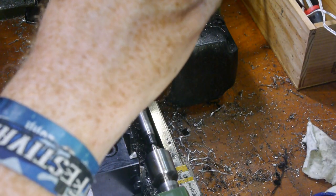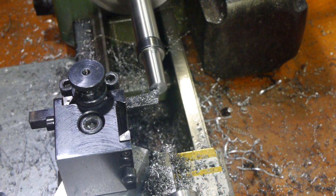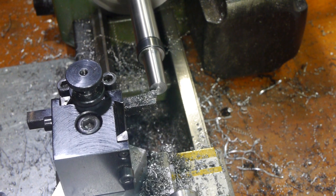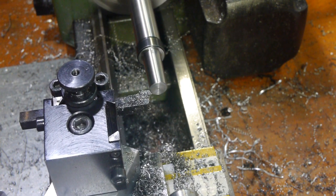The second lesson is that a part needs to be held very securely during a parting operation. I should have used the four-jaw chuck, which has a larger bore. When the remaining diameter became too weak, it bent, and the resulting pinch tore the insert out of the parting blade, twisting the metal. The part was fine, however, and the remaining diameter broke apart easily. The remnant of it was easy to clean up, and after a finishing pass, chamfer and deburr, the part was ready to try in the tailstock.